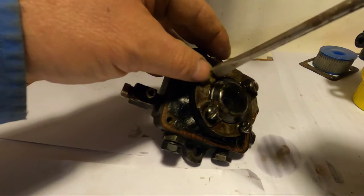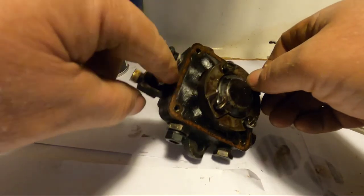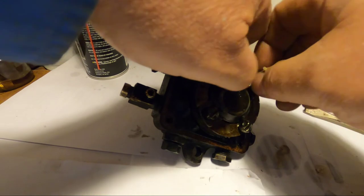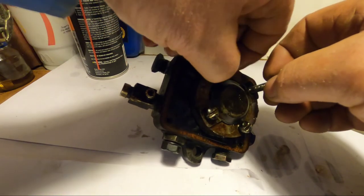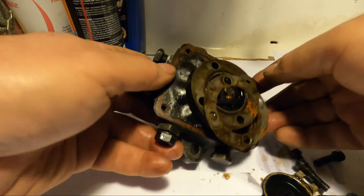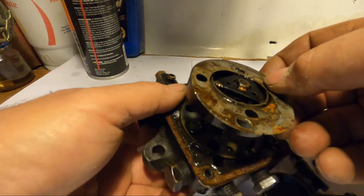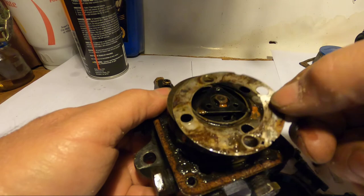Feeds the boiler itself, but it did come out of the bleeder tube. So what I did, I just kept running the boiler until I got all the dirty fuel out. I get a lot of condensation in my tank. In the beginning of every year, I have to drain a gallon or two out because I get that muck in there.